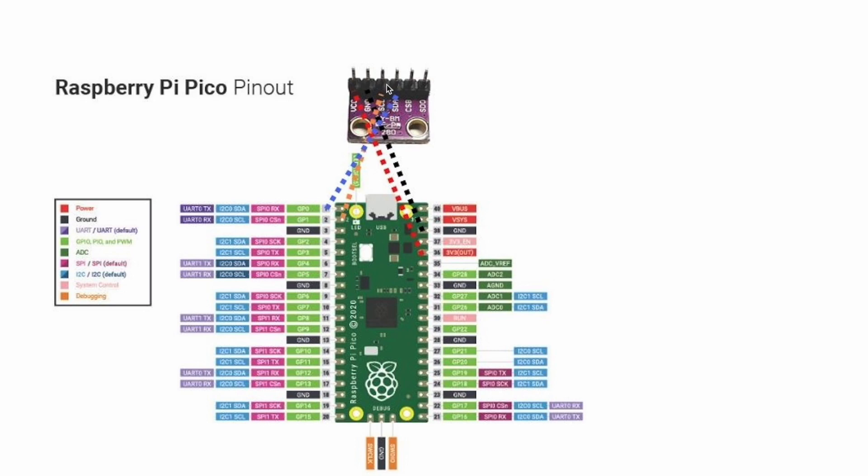The orange wire is the SCL link — connect SCL to pin 2 on the Raspberry Pi Pico W. Finally, connect a jumper wire from SDA in blue to pin 1 on the Raspberry Pi Pico W. I'll put a link to the schematic below if it wasn't clear, but hopefully those connections are clear enough for you to make.